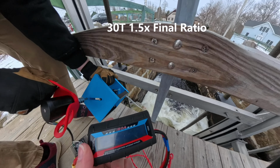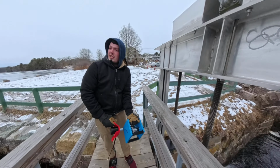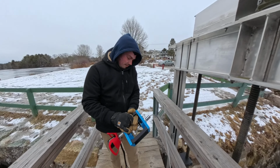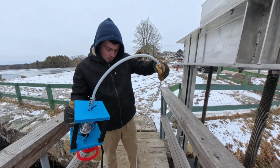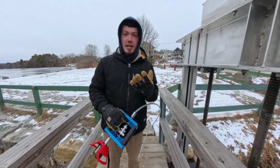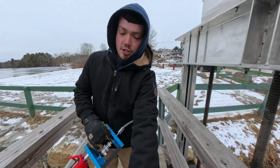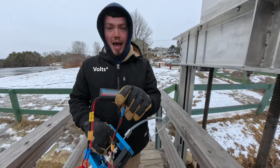It's flickering, right? Right there? All right, so you want to bring it up? So this was kind of what I was worried about. I don't know if it's because there's too much torque on this end, but what I actually think is that this turbine isn't producing enough RPM to light up the screen. This screen requires about, I think, 6.5 or 7 volts to light it up.